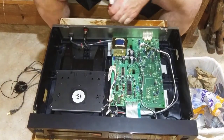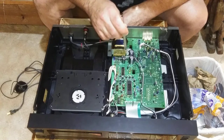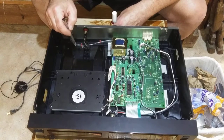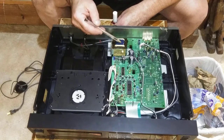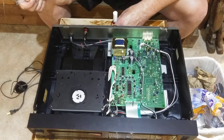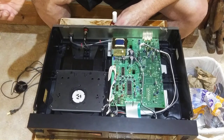Now I'll show you what can cause the power transformer to go bad and start a fire in your house without overcurrent protection. See these rectifier diodes down here? There's one, two, three, four. If one of those goes bad in a shorting condition, it can get this power transformer very hot. This cord is only rated for about seven amps, and the house fuse is 20 amps. So while this is shorting out and burning, it's at the mercy of the house fuse — it can be overheating this cord and short out, starting a fire, like if there's a drape laying against it. That is why I put the fuses in. Always consult with an authorized service center before doing this, because if it's done wrong you can create a shock or fire hazard.